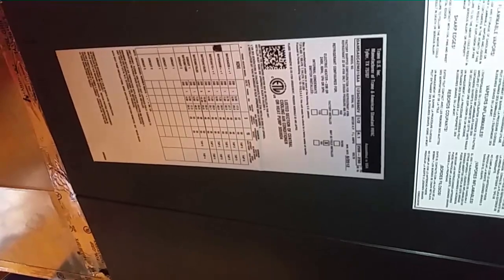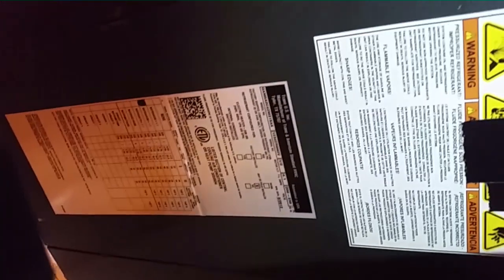We're looking at a GAM-5 air handler, Trane. It's kind of a tough installation because I've got to sit in between the drain here. The refrigerant line curves over here, and I am no feather, so that is hard. The GAM-5 should have a mechanical TXV. If this were the TAM-7, it would have an EEV. So I'm going to take a peek inside just to make sure there's nothing obviously wrong with it, like the bulb broken off and dangling.